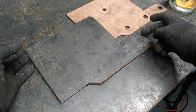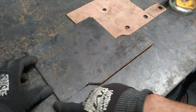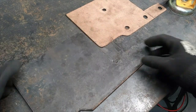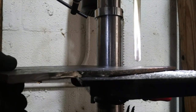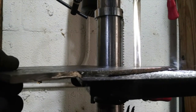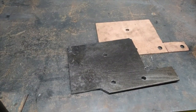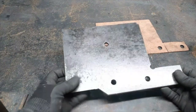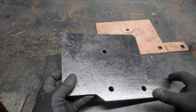I still have to round off these corners, work this area a little bit, and clean it up. But that's pretty much that. The next step is to drill the holes. All right, we've got the holes drilled out — now I'm going to go to the grinder and give it a little character. I'm going to round off these edges.